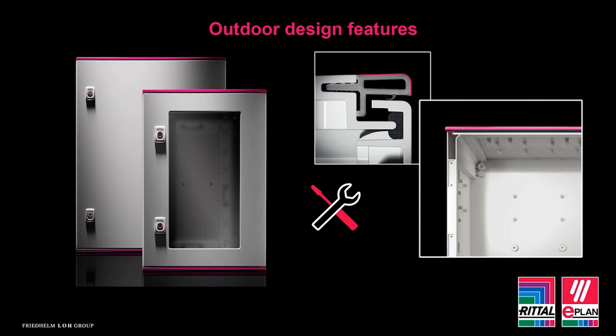On this enclosure, there's the ability to create multiple internal configurations of the internal equipment without damaging the integrity of the enclosure, due to the mounting domes that are inside. We can simply screw components and accessories into these mounting domes. I'd suggest, if you choose a GRP enclosure, looking with the manufacturer first at what offerings there are for the internal fit out. As we can see on this one, we've got the different types of mounting domes, but not all GRP enclosures are manufactured that way. So like I said, it's something worth considering in terms of future-proofing the enclosure. Is the internal configuration right now? Will it be right at a later date? What are your options for upgrading that cabinet at a later date? So I said, do speak to the manufacturer on that.